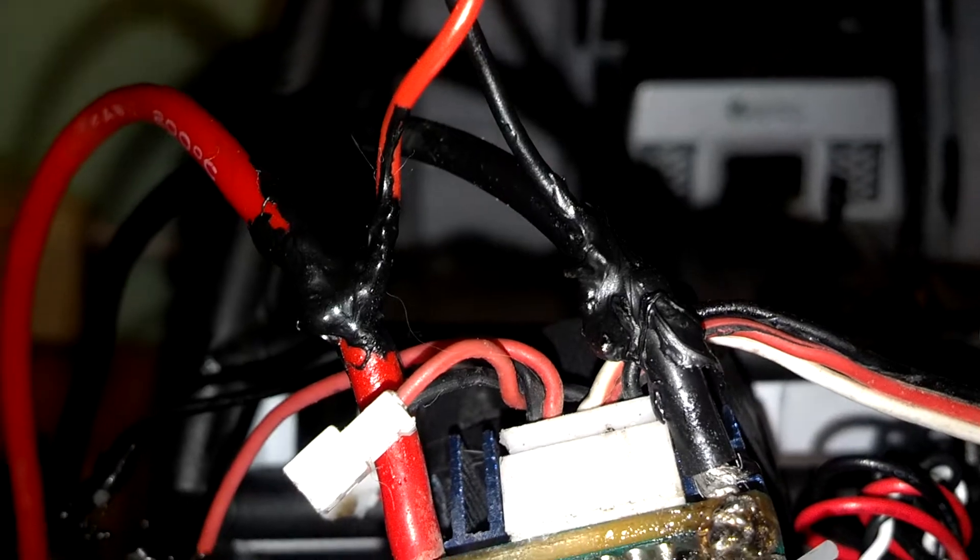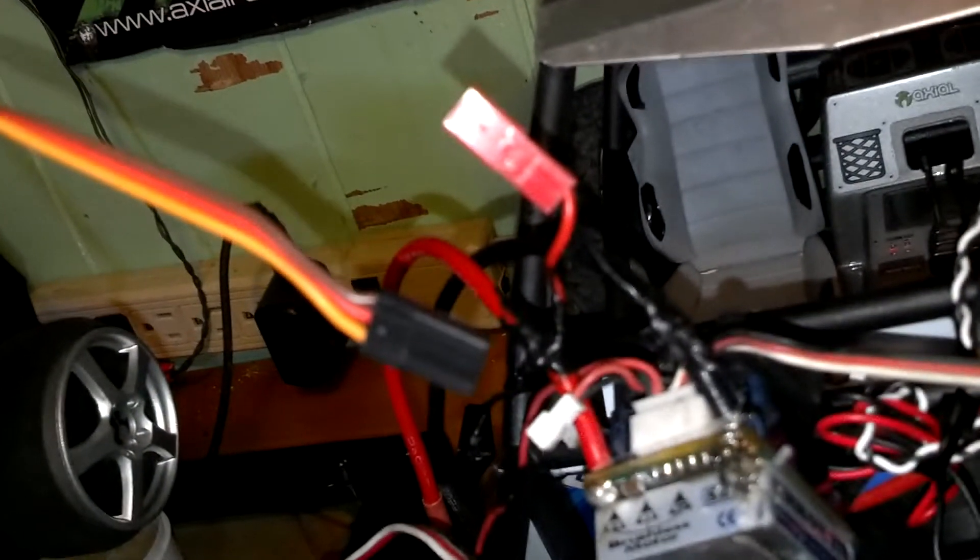You can see there — I'll zoom in a bit. I just hardwired it in there. It looks kind of messy because I used liquid electrical tape to cover it up; I didn't have any actual electrical tape. On this end I have the other side, so this plugs right into there — like that. Then this side plugs into just a spare channel on the receiver; doesn't matter which one. Then you have to take your ESC three-wire and take out the middle wire.